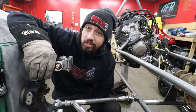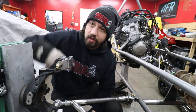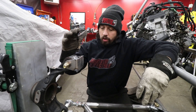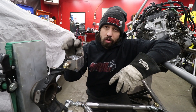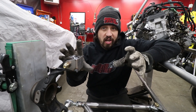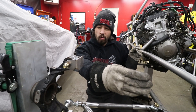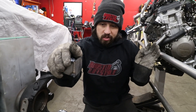You might have noticed in that last clip I used a wrench — that's because I couldn't ground through the rubber bushing so I had to use something that connected to the chassis so it would ground for my welder. My plan has always been to use the Miata hub because it probably has good geometry from the factory, so I'm using the top and bottom mounting points from the factory basically. If we need to, we can swap the rubber bushing for an aluminum bushing or a bearing. We're going to build some arms that weld directly to this piece with heim joints on the other end, and I'm going to try and make them a little bit wider for more stability.